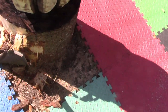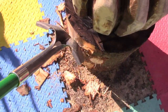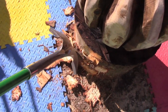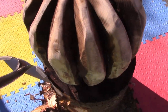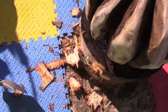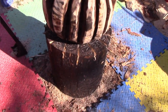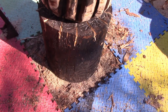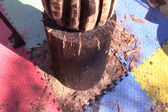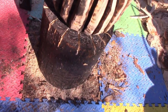You can get in and tear the bark off if you get the corners in, you can crack it out. Anyway, you get the idea. So it's about finished — sanding's done, though it took a lot longer to scrape the bark off. Tip: if you ever cut down a tree, scrape the bark off the first day. It's really easy. The longer you wait, it glues down and gets harder and harder.